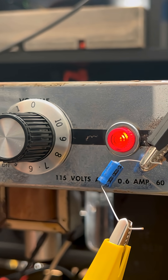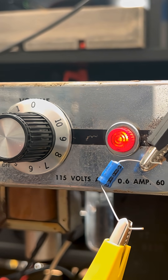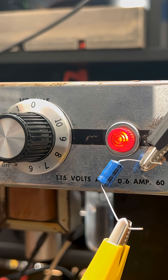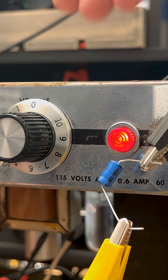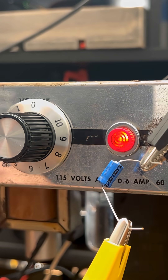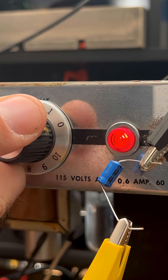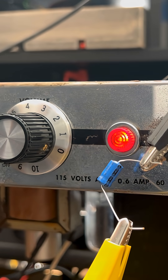So why don't we take this same cap here and bypass one of the cathodes in the preamp end? I'm going to leave this grounded here — that's not where it should be grounded, over here with all the dirty high-ripple stuff — but let's just hear what it would be like to get a little more gain out of the preamp where it's not going to impact the speaker. Let's put her on four. We already have some clipping there.